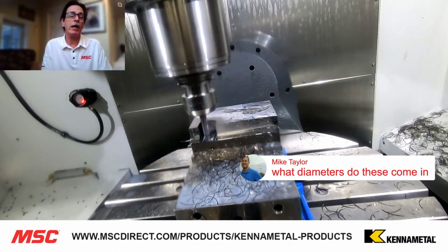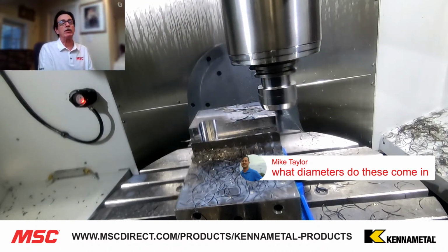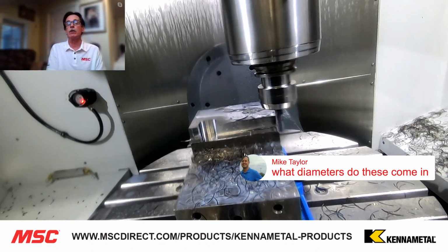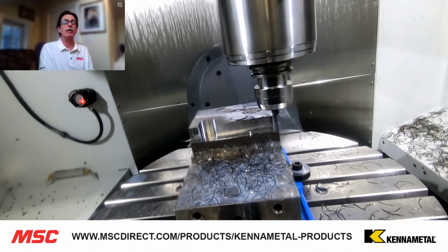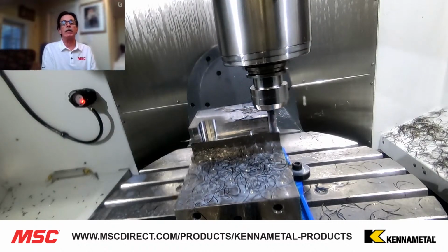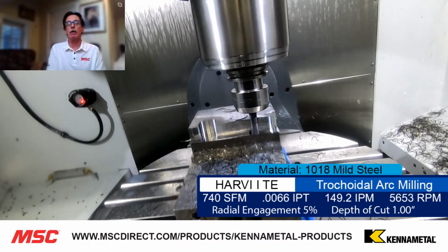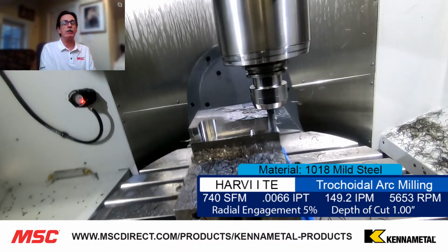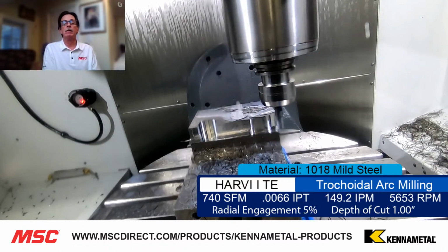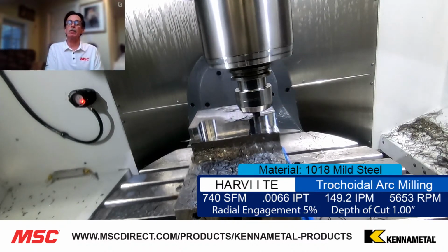Yeah, this has a great range, greater than most you'll see in the industry. It starts at 1/8 and goes all the way up to 1¼ inch. There aren't a whole lot of manufacturers that offer 1¼ inch diameters standard on the shelf. It has an extreme range of radius offering too. All the standard aircraft radiuses, that 1¼ inch is very popular for me in some of my larger aerospace accounts. So it's a great range. It's the same in metric. Not quite as large a diameter on the top end, but 1/8 inch and 1/4. You won't see that range in many end mill offerings.